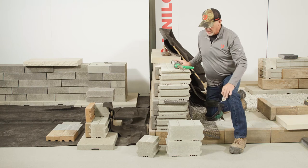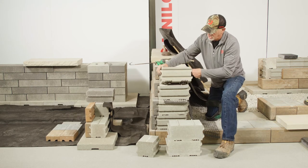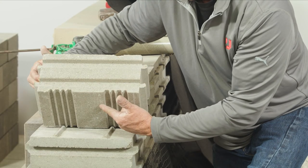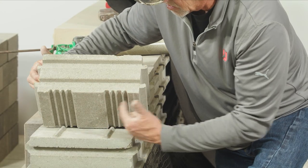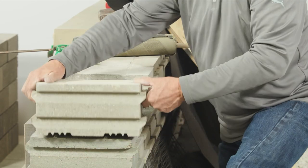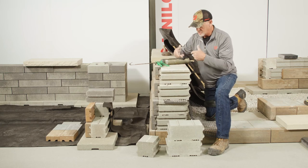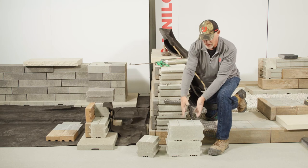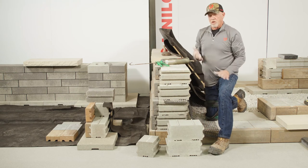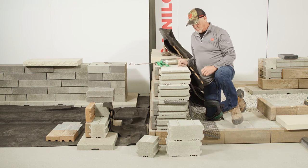Recognize your glue points here on this standard backer. This is our true glue point here in the center. These channels here won't provide any contact from this course. As you're setting this block down, you don't really recognize those channels — you're looking down upon the top surface as you would set that. So recognize on your glue points that you want it centered.